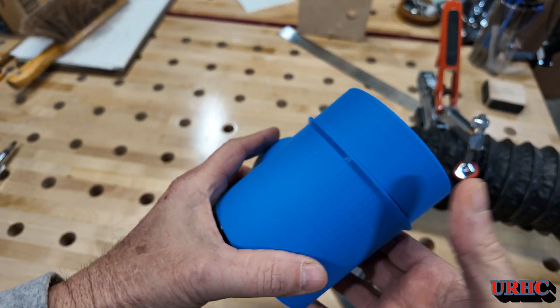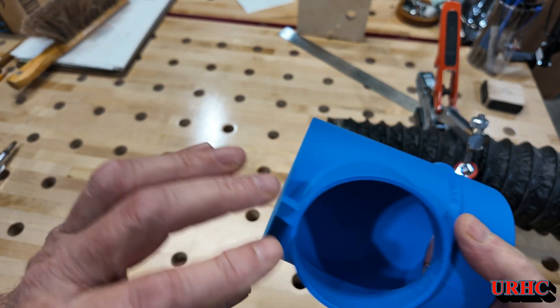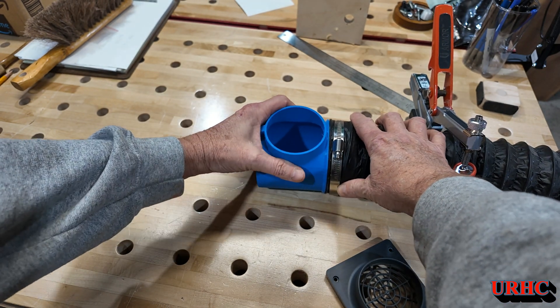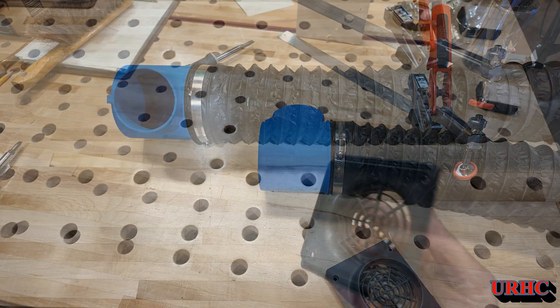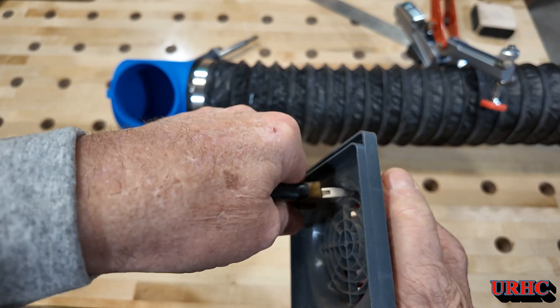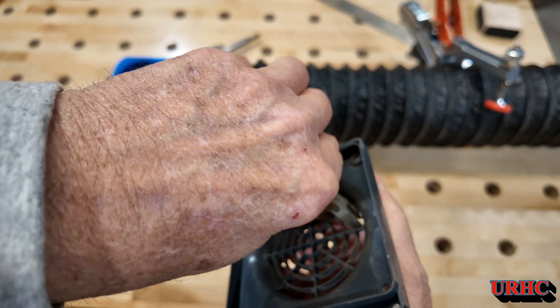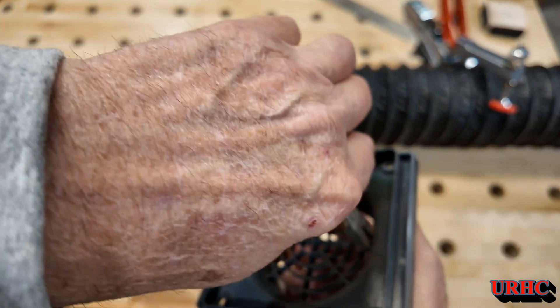You've got the wide open flow for one fan to push and the other to pull. As long as you remove the back pressure on those inline fans, they can really move a lot of air. With back pressure on the input side you've got a problem. It fit on there perfect. I decided to cut that grill out because it's blocking so much of the airflow too.